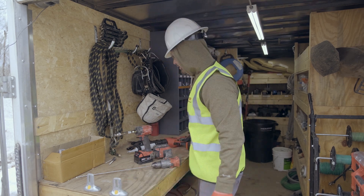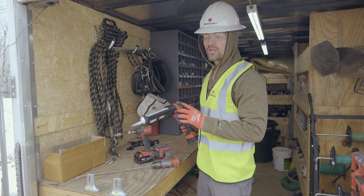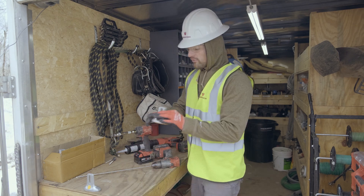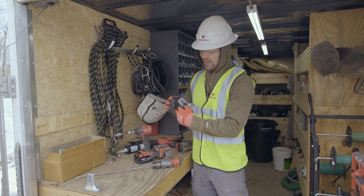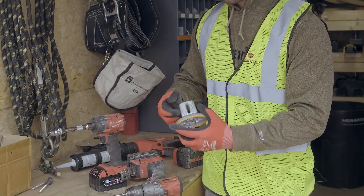What I've got here is some sealant that we use to seal everything off — there are no leaks. We only have one penetration in the roof per flash lock and it's a pretty seamless operation. This is the base for everything, the only interface with the roof and the structure. You can see there are some serrations for the rail to make sure it's tight and locked in place when we go to anchor it with the appropriate hardware.